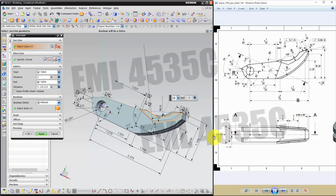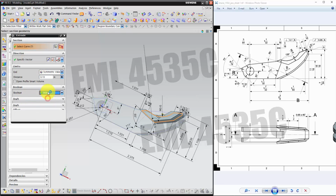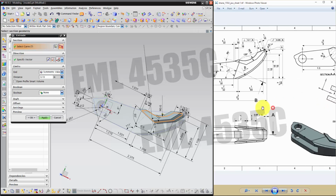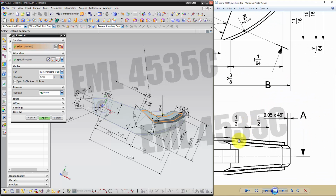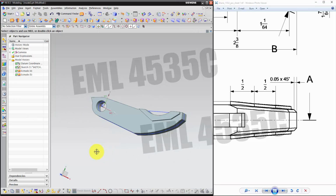3/4 divided by 2 is 3/8, and we don't do a unite here. The reason being is we need to cut that later, and that's two different cuts. If you unite them, you will not be able to make the lower cut, the 6-degree angle tapered head. So don't unite them.